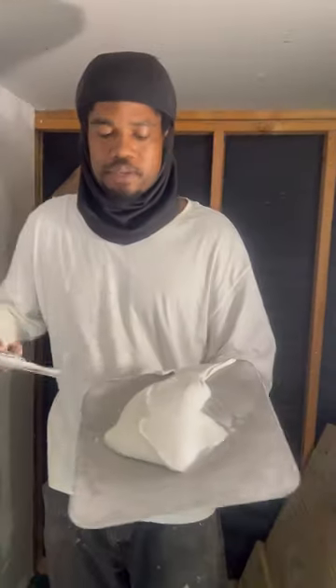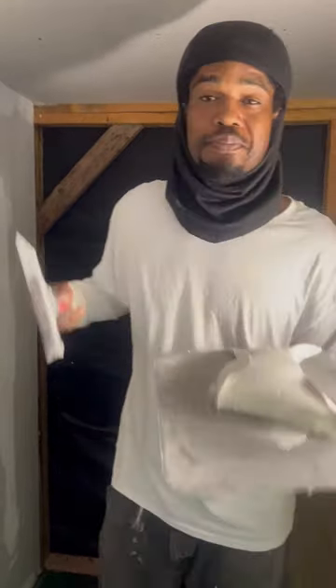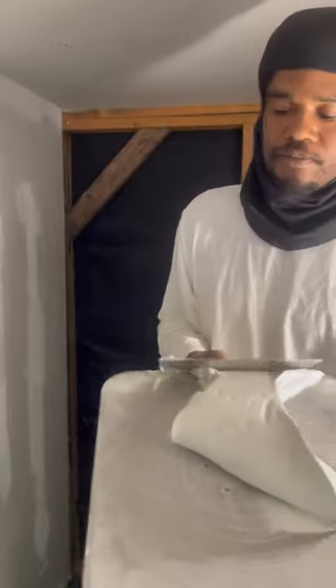Okay, Temple Builders, today we're talking about your drywall coating stage. During this stage, we're going to be using plus three joint compound. I also have an eight-inch knife instead of a six-inch knife.